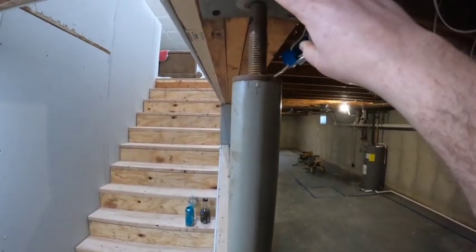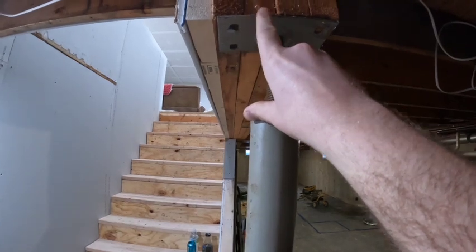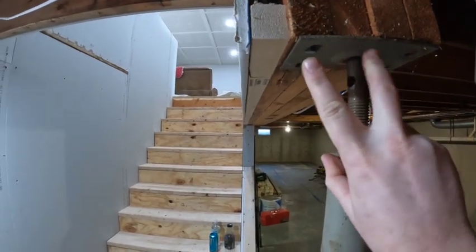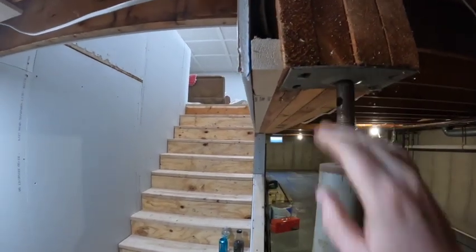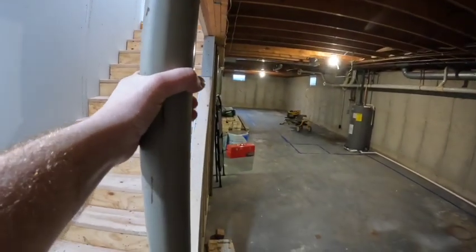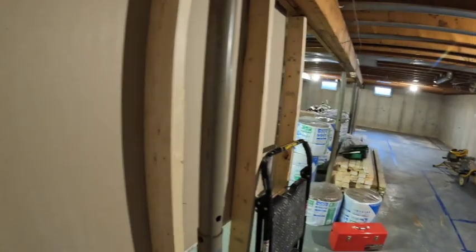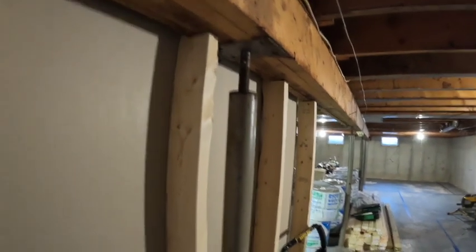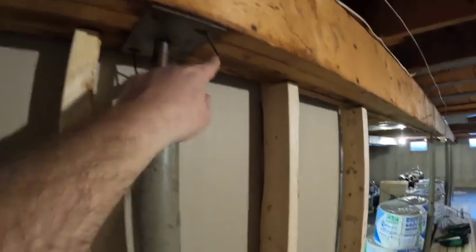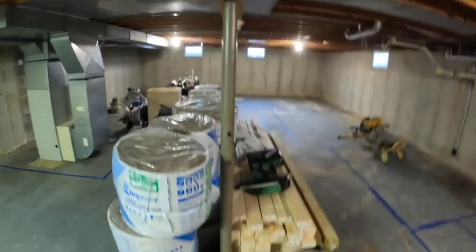And then what happened up here is they think the foundation kind of shifted a little bit, and because of that, this caused this to shift. Because look at this, this is like a 1/8 or 3/16 plate holding up half of the house. That is overloaded. And again, these are more or less temporary jacks to build the house. They should have been replaced with framing long before this. That plate's straight, but like oh well, we couldn't get the nails in, so we'll just leave them like that. And come on, no fasteners in the bottom, and they're just all out of whack.